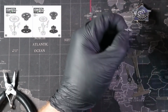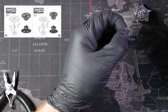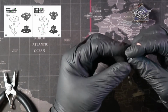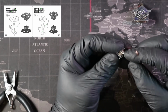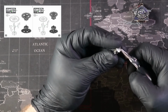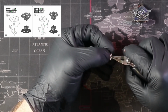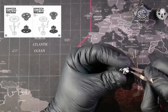Okay, it looks like it's more gear time. Much like our drive gear, these require us to pay attention to the details to make sure that we're putting the right part in the right place, but we also need to make sure these are properly sanded too. We're going to put these guys together in the same way as before. Line up the key, use the gears to help you get everything together. Then secure the parts at the eyelets. We have a whopping 5 of these to do. Rinse and repeat. And once we have all of that done, we can move on to making our top gear assembly.